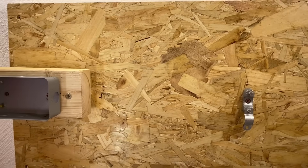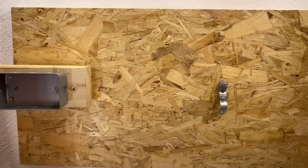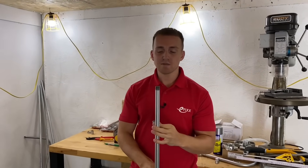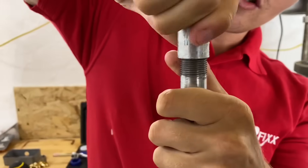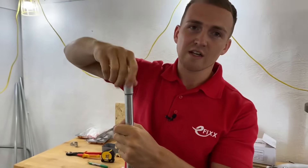So the double set — if we did one previously at 50mm — this one's going to be 70 millimeters once we take off the depth of the saddle. I've got my length of conduit here. Because we're working from a fixed measurement, I'm going to put my coupler on first, making sure it's firm but not super tight, which will give me room for fine adjustment later.